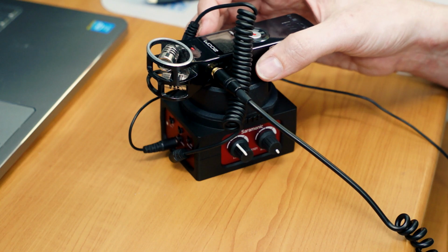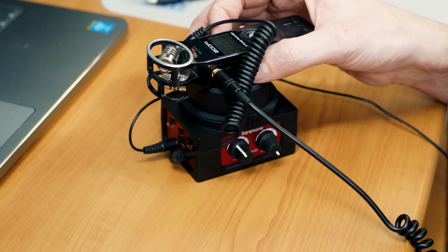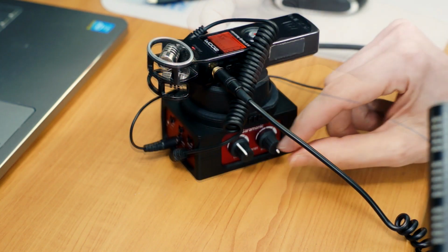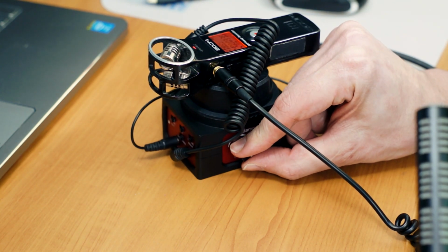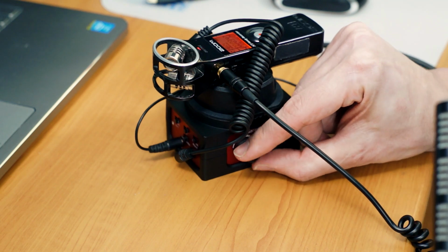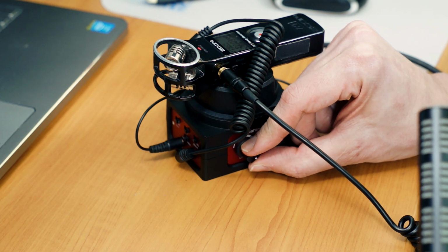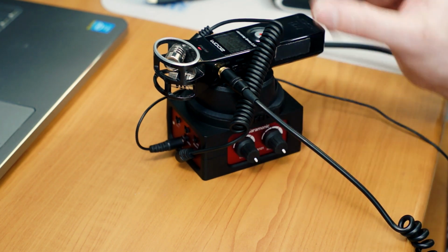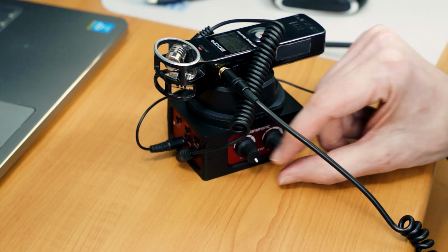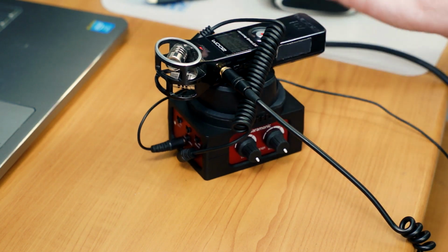It's at the full level it can possibly put out here, and so I'm actually going to show you what I'm talking about here. You might notice the noise floor is rather high, but I'm going to turn it way down now. And as a result, the microphones are going to fade here for a second. Now that previous level was 100 on the Zoom H1 because the Radio Shack mic is so weak. But now I can turn down the Sennheiser and it should sound a lot better because the noise floor is now a lot lower opposed to before when it was turned up all the way to 100. Now it's pegged all the way here, but it's set at about 55, and it should sound a lot better. Of course, the Radio Shack mic on the right side now is very hard to hear because it's turned so far down. But you can kind of get an idea what this type of an interface does.